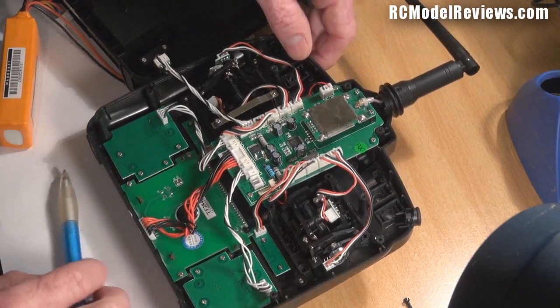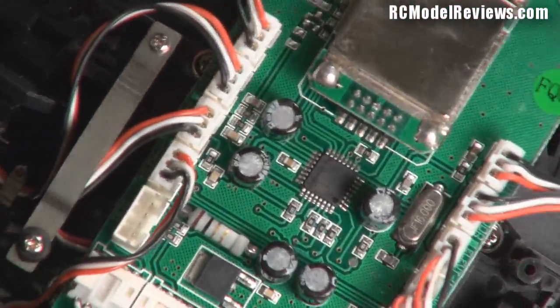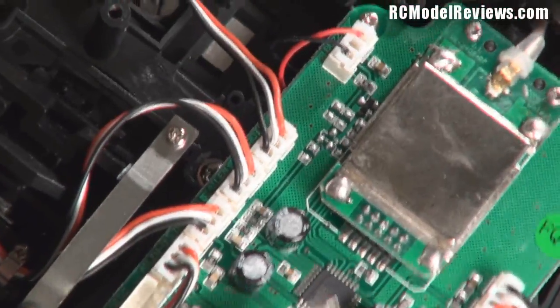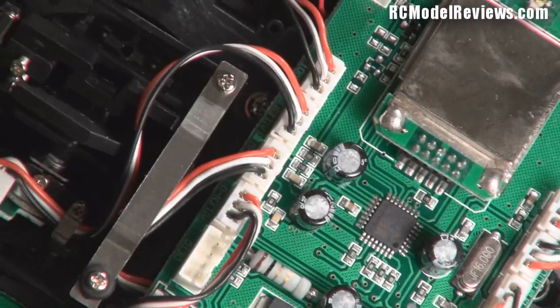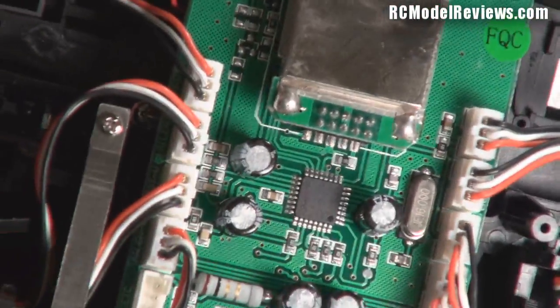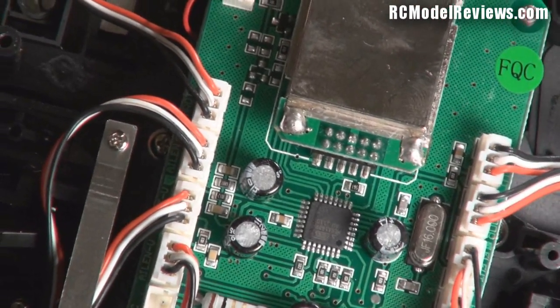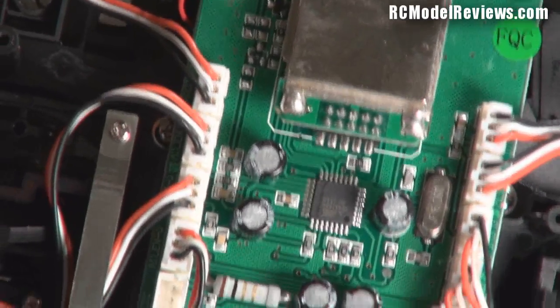The RF is all tied up in this tin box up here. Here's a close-up look at the circuit board - it's got an ATmega168 processor. It's small fry by modern standards, not a particularly powerful processor, but it's all you need for a four channel radio like this. ATmegas are quite commonly used - the Turnigy 9X uses an ATmega or Atmel processor. We've also got a little voltage regulator down here.